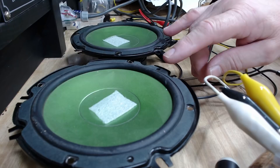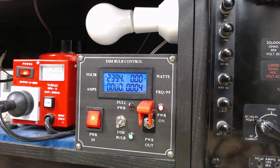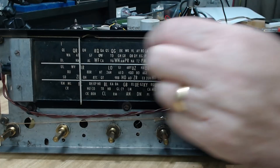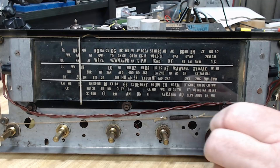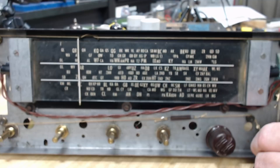I'm going to put some power on it - I won't touch anything before I do. I've got two speakers at the back, I've put little indicators on so you can tell they're moving. I've got it on a dim bulb - nearly 240 volts, that's about right. I've connected an aerial. So there's no reason this won't work. I've put a knob on to turn it on - I think that's radio. I've got a light on there and a volume. There's something... that's pretty good. I've just put it up near ZL there and it's right.